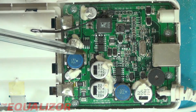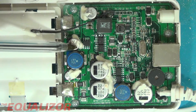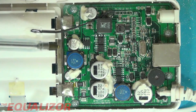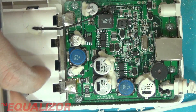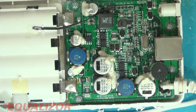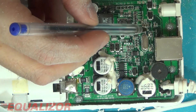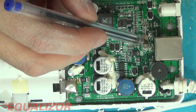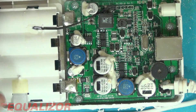We've got a couple of really nice big 25 volt 680 microfarad caps in there - I'm definitely going to be having those off the board. That's a 220-25, another 220-25. There's some sort of a 3.6 megahertz crystal here, so maybe it's got some sort of microprocessor. There's a little chip down there, and I can see a couple of components that look like LEDs marked H1 and H2 - normally those would be capacitors, so that's interesting.